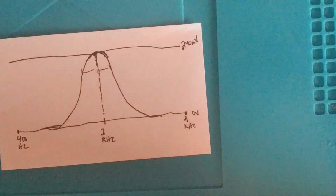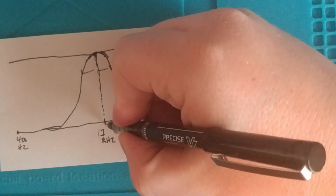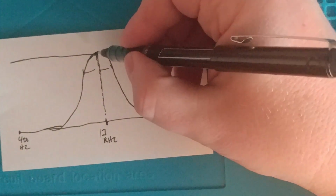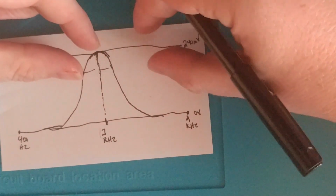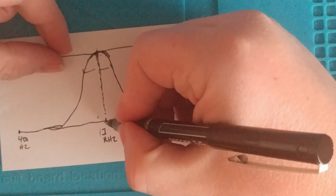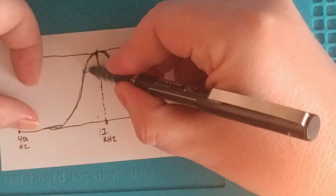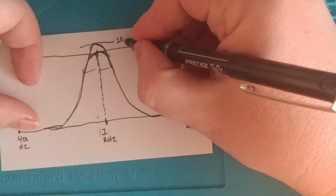Now, what I'm attempting to do in this measurement, or under test, is determine if the frequency on the dial actually represents the frequency that I'm injecting into the equipment. So as the dial sits on 1K hertz, when I take the mid-range frequency switch and set it to 1K hertz, I want to know that as I increase the mid-range amplitude with the second dial, from bottom to top, I am actually increasing the amplitude of the frequency that's on the dial. So if the dial is correct, then when I'm increasing amplitude, that means I am only increasing the frequency that I've selected, which would go up to whatever is that next range, 280 millivolts, whatever.